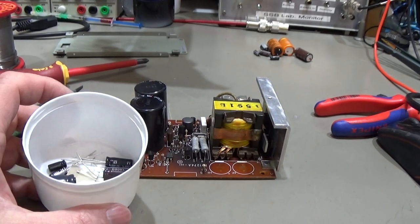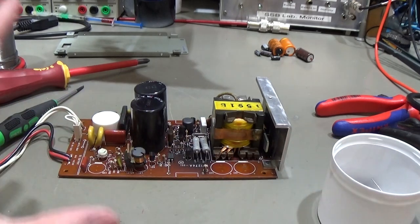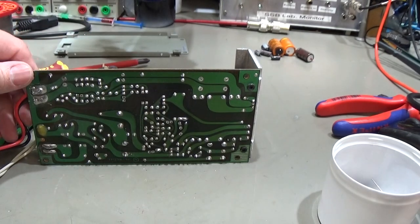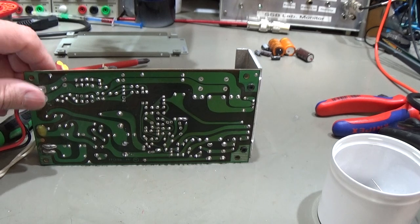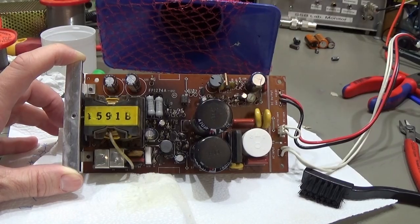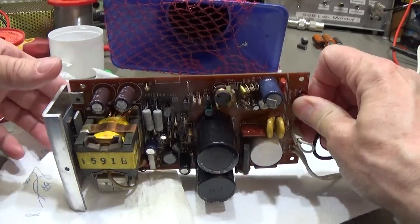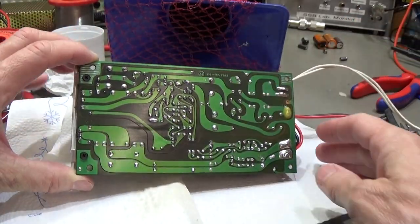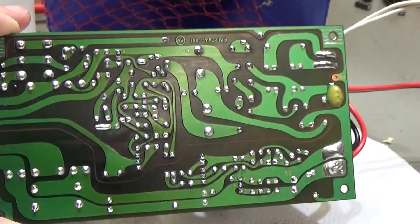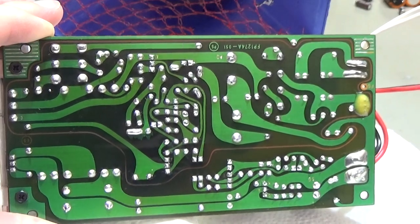Okay, and I have now our new capacitors. All are 105 degree types, and we can assemble the board, and then of course do the solder points new, and then hopefully our power supply will work again. Now all new capacitors are in, and important as well, the board is completely reworked, as you can see. Looks pretty nice, almost new. And now we can test if it works.